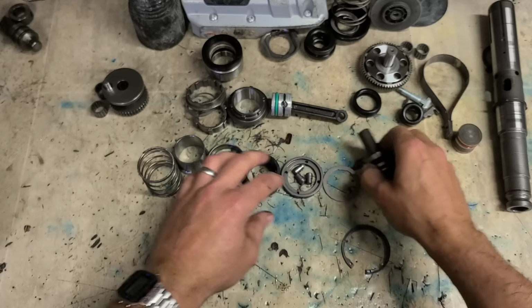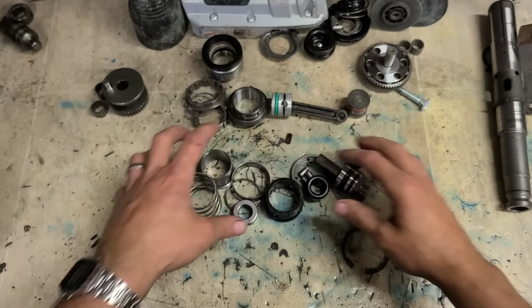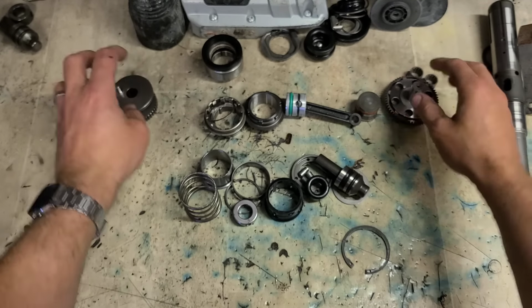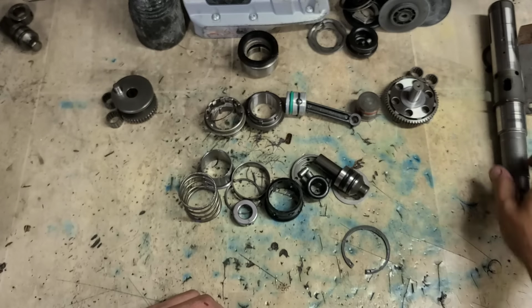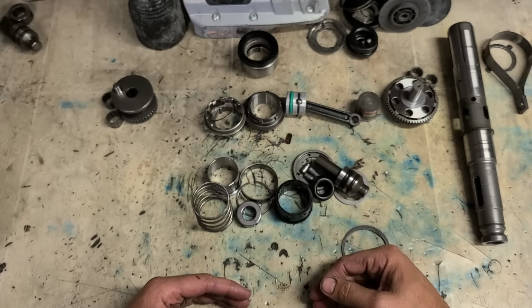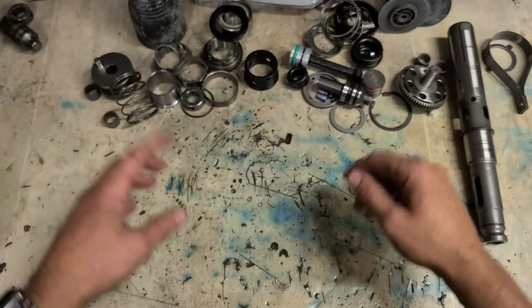These pieces then are all for inside your hammer pipe. And there are your tool holder parts. So that's what you end up with. Piston striker, your actual gears for rotation, your crank, your clutch, all up here is your tool holder, that's just your cover, your seal at the front, your actual hammer pipe. This is for everything inside the hammer pipe then on the outside. So once you break them down into sub-assemblies, they're actually not that complicated. Fairly easy to do. It's just the way I'm doing it. Looks complicated when it's scattered around like that.